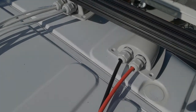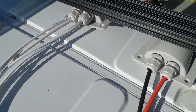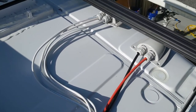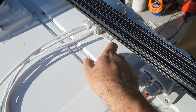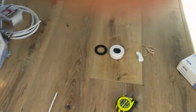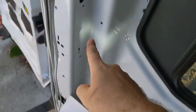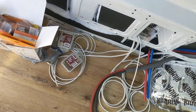And this is how it's going to go in. I was able to put two cables in each hole there, and I'm going to cover it with some lap sealant and silicone. Haven't drilled the holes yet, but that's pretty much it. I don't need to show you how to drill a hole and butyl tape that down. These are going to go directly into the panel. I'll go ahead and show you real quick. They're all going to come in right there, and then I can run them straight down right where the electrical panels are going to be. I'll see you in the next video. I hope this was helpful.